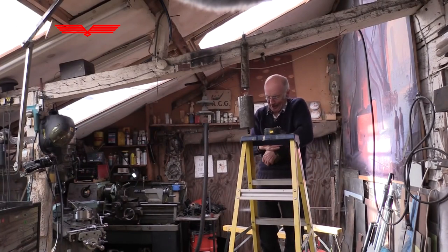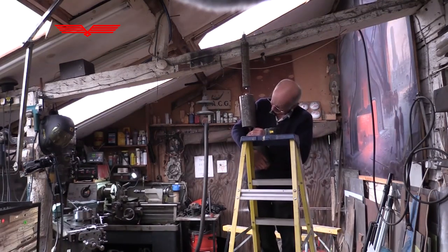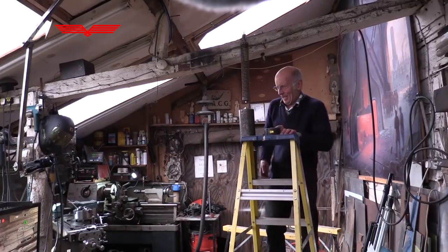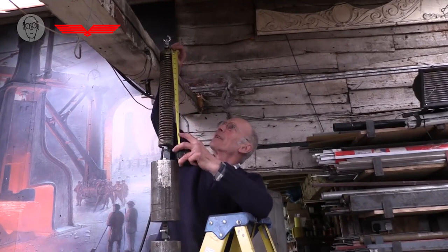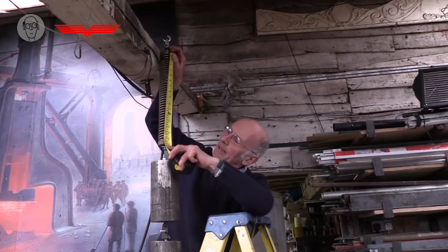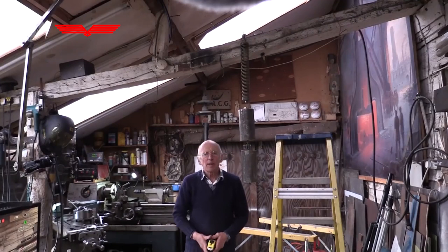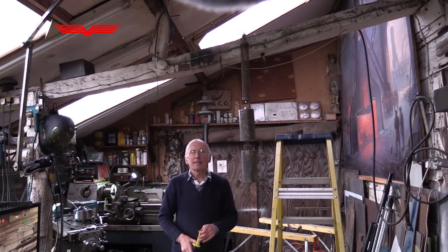Another one of these monstrous 15 kilo. Whoa, that was a bit of a struggle. So now we've got two of those weights. And the elongation is now 420. So the elongation is just about twice as much. So basically, you've got twice the load and twice the extension.